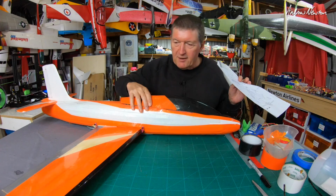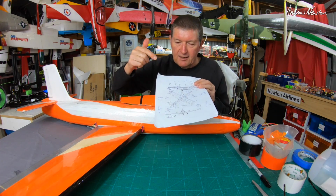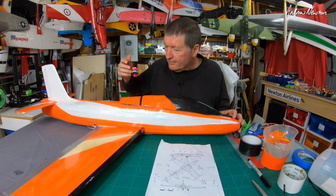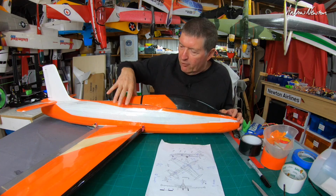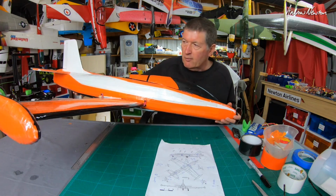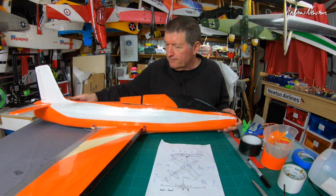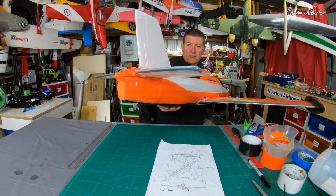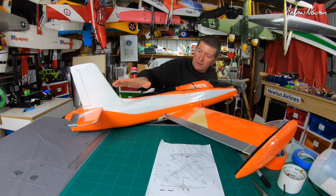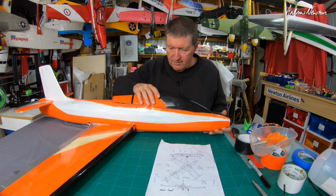It has quite a different body shape, so using the cross-section shapes on this diagram gives me a really weird shape. And I've had to cut the formers and glue them back together to get the basic retro cigar shape that the MB-326 has. I've made up the tail section so it looks kind of like the real thing. The horizontal stabilizer is up higher than the real thing, but that's cool. Easier to build that way.